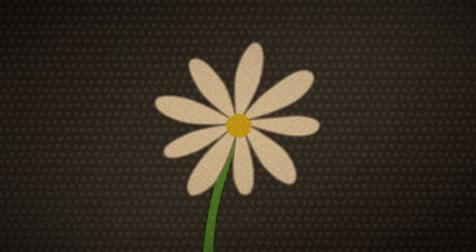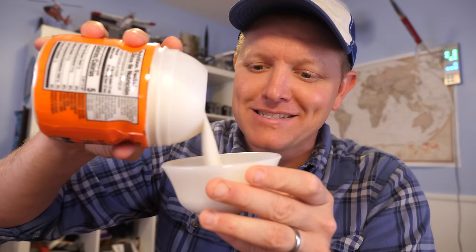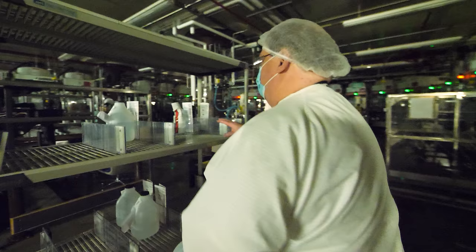As we talked about in the film development episode with Indie Film Lab, film emulsion consists of silver halide crystals suspended in gelatin — and yes, gelatin is the same type made from animal bones. It starts like a powder; Kodak does something very similar and then melts it to create different mixtures. Color photography film is created by laying down different layers of silver halide crystals mixed in gelatin. Some layers are designed to capture certain wavelengths and intensities of light, while other layers may be designed to filter out certain colors. By varying the chemistry and sensitivity of each layer and cleverly stacking those layers, Kodak is able to make them work together to record a full color image. Each layer has to have its own separate chemical makeup, which can be very complicated.